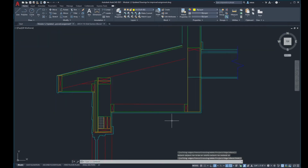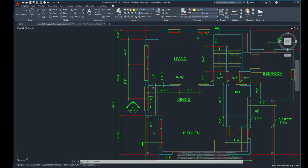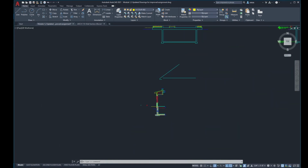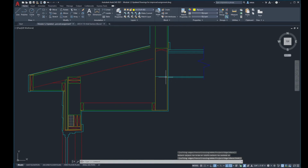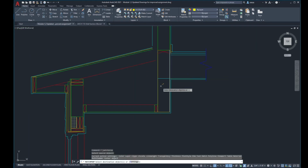So this beam is being supported, let me go up to my plan, at this corner by the wall and this corner. Now this wall could be a bearing wall, so you could actually have a beam spanning to this mid wall and then another beam here. I think I've sized it to take this entire opening. So that's that LVL right there. So this line actually gets trimmed like that. Oh wait, no, this line comes down. That becomes yellow because that's, actually that becomes green because that's cavity as well.